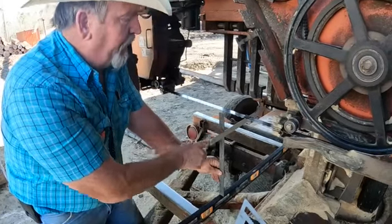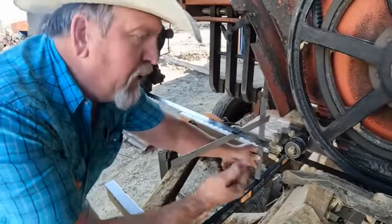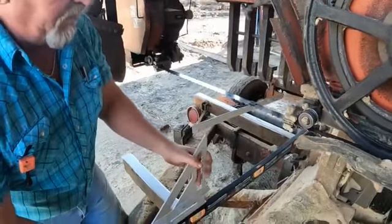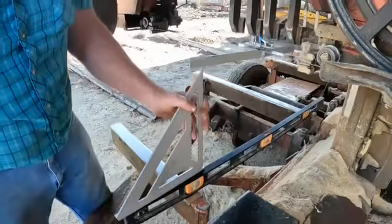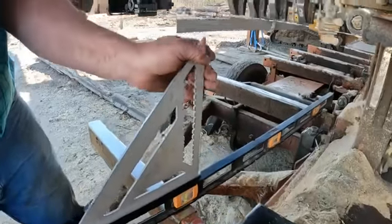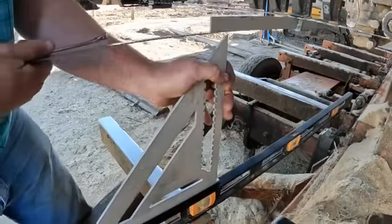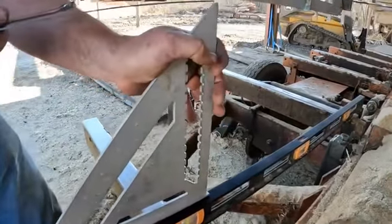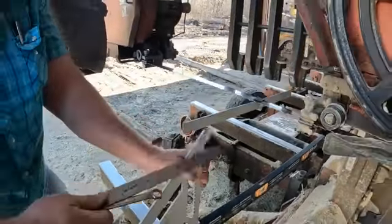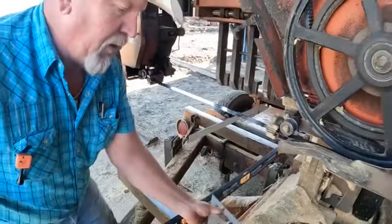If you've got it on a set-down tooth, that tooth is going to push the tool into the blade guide roller a little bit. So you always want to make sure you're in a gullet. Also make sure your blade is clean — if you've got sap buildup on the top or bottom, the alignment tool is going to be aligned to the sap, not the blade. I normally do it with a brand new blade. You measure up from that bed rail to the height of the top of the alignment tool, then reposition the head so the rear part of the tool is over the same bed rail and measure up to it.